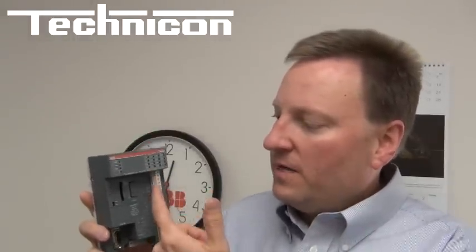We also have flexible I/O. The analog inputs can be used as digital inputs, and in our flexible I/O, some of the add-on modules allow digital inputs to be set up as digital outputs or vice versa, so it's a very flexible system. The built-in power supply is great — it's nice to be able to use this unit with 120-volt power without a separate power supply. If you have 24 volts, we have a 24-volt version as well.